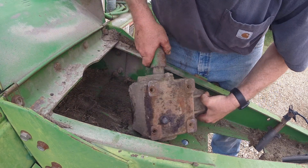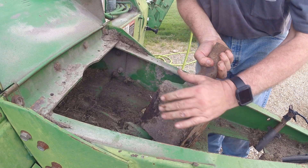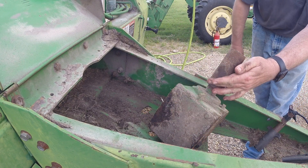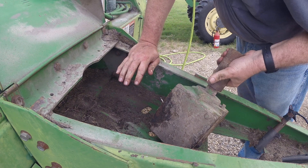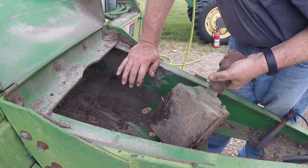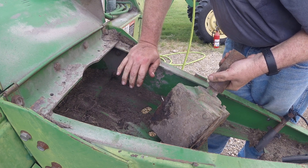It really has more to do with the speed the tractor is designed to run at. My tractor is designed to run at 540, but this baler is designed to run at 1000 RPMs on the power takeoff. So we're converting it, and luckily this baler lets you do that pretty easily.